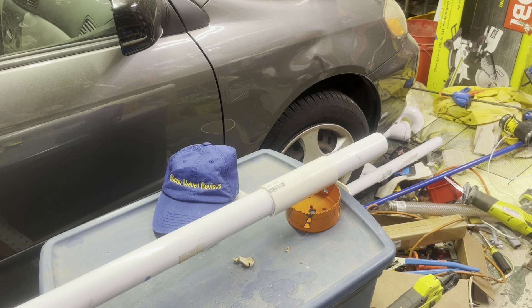It's still better than cutting with a handsaw and trying to deburr. With plumbing I don't really care because I can snake it and have a snake, so it's easy. But with central vacuum you do not want it to get clogged — it's not going to be easy to snake out central vacuum like it is with running water. So you do not want burrs or anything that could cause a clog.